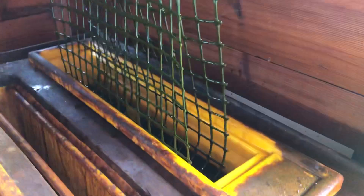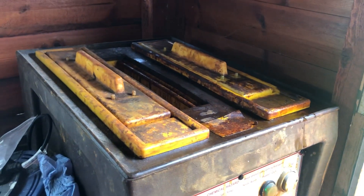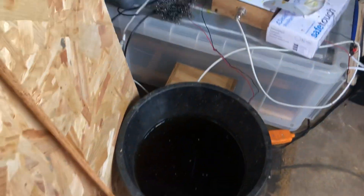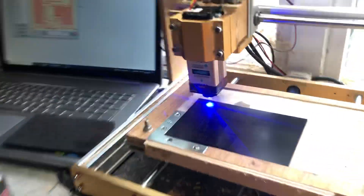I've just set it on to warm up and it's now reached temperature. It's a ferric chloride solution — takes about maybe four minutes. I just dump the board in there, set my timer for four minutes, and then it comes out. I basically put it into a bucket of cold water, wash it off — gloves always — and then put it into a tray of thinners just to wash the rest of the paint off.